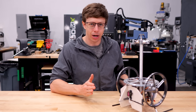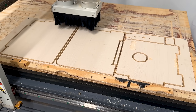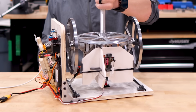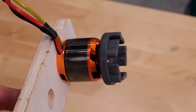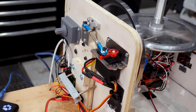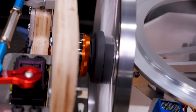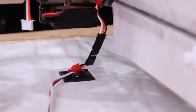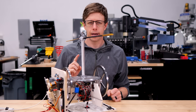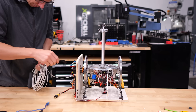Before we can test it, we need something to spin the flywheels up really fast. This turned into its own project — the result is a dock the helicopter sits on. There's a motor on the side with a special coupling to interface with the flywheel, and a little computer that controls the spin-up speed. It slowly ramps the flywheels up faster and faster, and when everything's going fast enough it releases a trigger which quickly pulls the motor out of the way. It communicates with the helicopter over a breakaway cable, and can fly it autonomously or hand control to an RC transmitter.